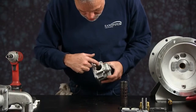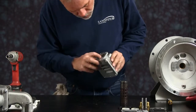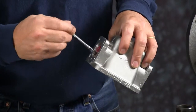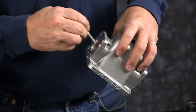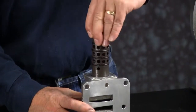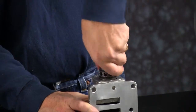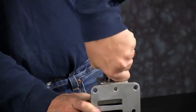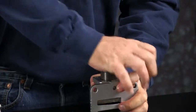You want to inspect the air valve face and the bore. Make sure there are no sharp edges in there and apply a little grease inside. Set the body on end, then push the sleeve in, twisting and pressing. Don't worry about getting alignment — just make sure you push it all the way down into the body. It will self-align once you put the end caps and the bumpers back on.